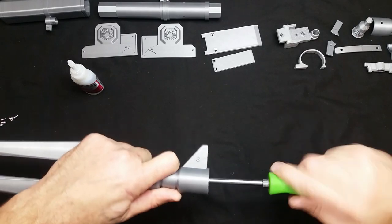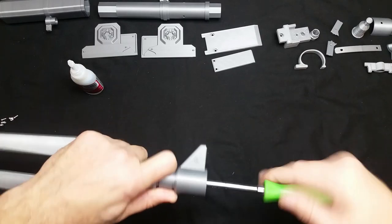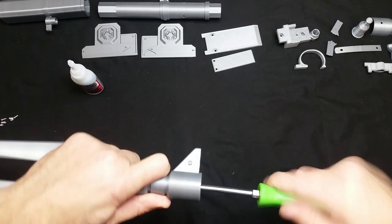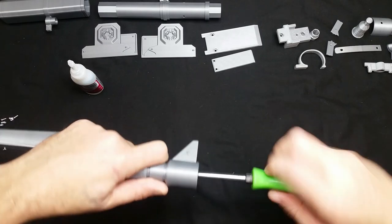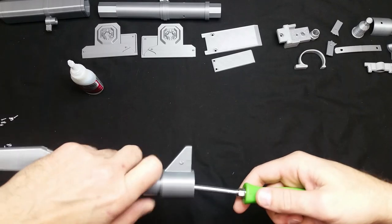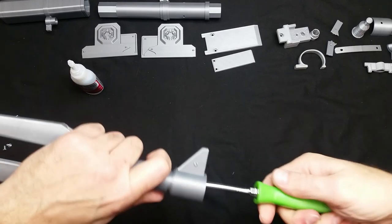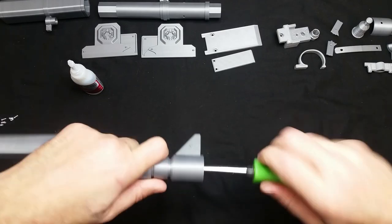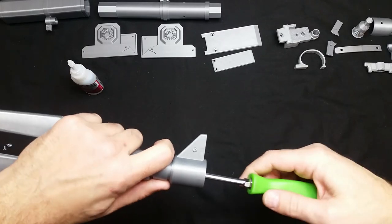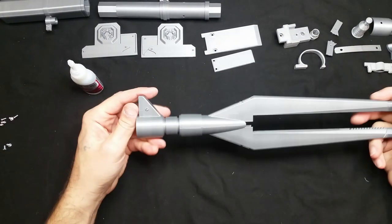And all these big ones are long-winded, and they generate a lot of heat screwing them in. So again, what I always do, I mean, you could just keep on going and going and going, and eventually you can pull all your threads out if you want. And I don't ever use a drill to put these in to make it go faster, because again, the faster you screw it in, the more heat you're generating. And heat's your friend to a point when you're dealing with any plastics or resin or filament or whatever term you want to use. There we go. That was hard. Fork's done.